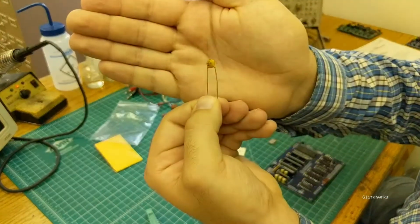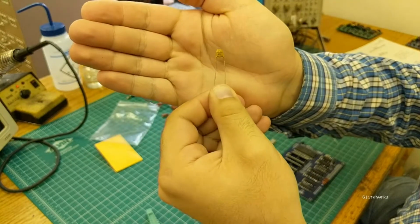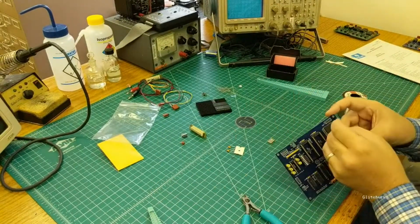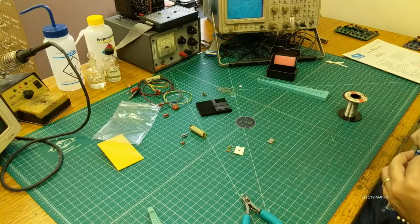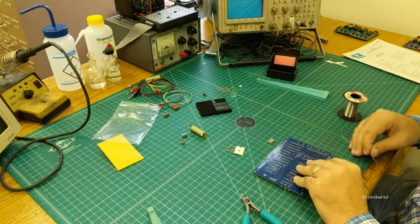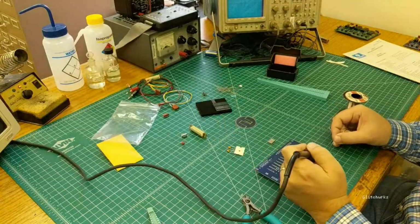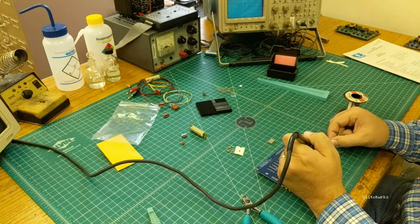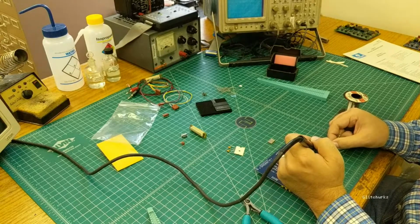These are the capacitors that we shipped with the hobbyist kits. It's the one that's not on the tape, and it'll have a 0.01 for the value on there. These are not polarized, so they can go in either way. And if you're getting a kit somewhere down the line, your capacitor may be a little different than that, just because we use what we have on hand, and it's not critical as to the manufacturer tolerance on it.